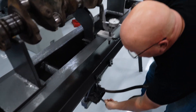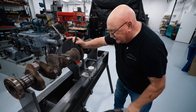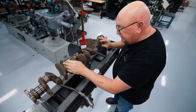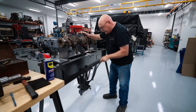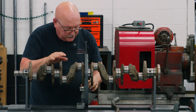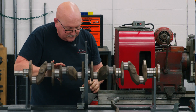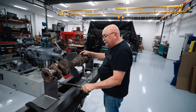I'm going to have to jack down again. I'll take it to a hundred and fifty thousandths, which is more than an eighth of an inch. Release — and it's still bent four thousandths. So I'll go to two hundred. It's always better to go in relatively small increments. That shows an improvement — it's still about three and a half thousandths, but it started to move at two hundred.